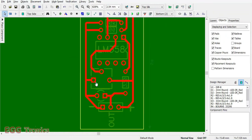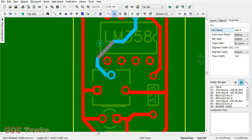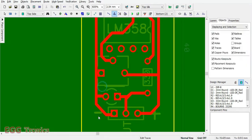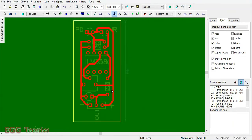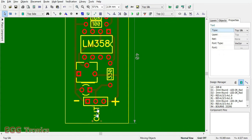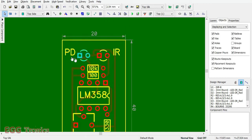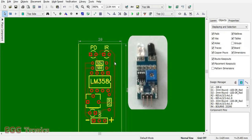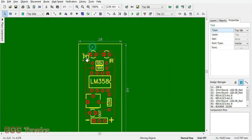We can move the potentiometer a little closer, shift this trace to the right, and move the 330 ohm resistor a little nearer to the IC. We can move this to the center and move this to the top so we can free up space at the bottom. We'll put the LEDs on top since there will be space there for bending them, as seen on the reference board. We can use the freed space at the bottom for component naming.